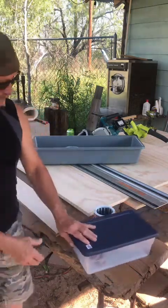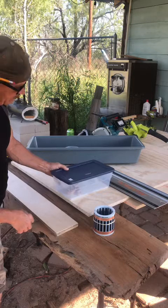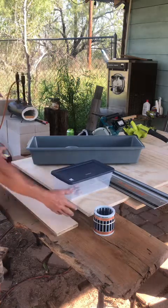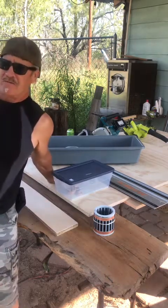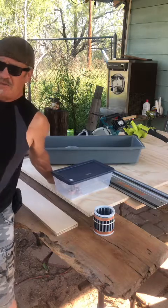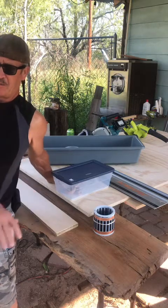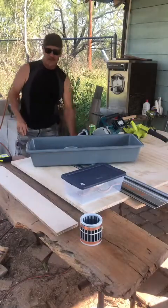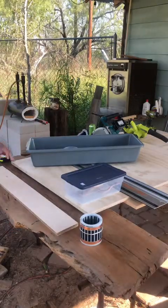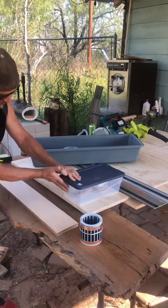And the way I designed this is a modular stacking system with room for, in this one I hold 4 tubs, but my new design I'm going to have 5, because this one's 36 inches wide. At 42 inches it can hold 5, and they're spaced in there nicely, and it utilizes the size of your standard lumber 4x8 sheets a little bit better. So I based this design around the tub, the 6-quart tub, and around the angle on the back.